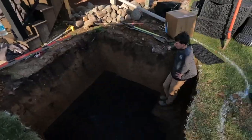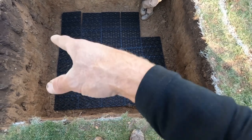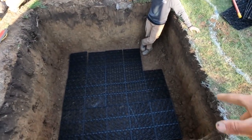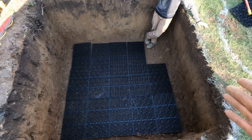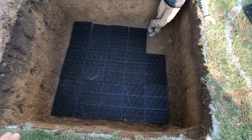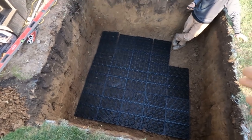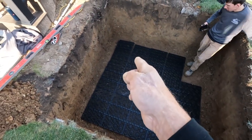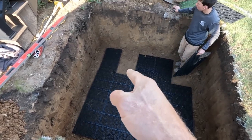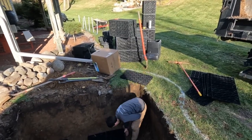We're making headway. We've got the reservoir hole dug. As you can see, we've dry-set 15 of our aqua block panels — actually technically 14; Jack represents the 15th. We just wanted to make sure while we had everything opened up that we had enough room on all sides so that when we put the fabric liner in and then the aqua blocks we wouldn't be fighting any of these walls going all the way down. The pump vault is actually going to sit the second aqua block in from that last row where Jack just pulled out the panel. He's going to go ahead and mark that and get that dug. In the meantime I'm going to keep up with him and get the rest of these 15 double-stacked aqua blocks set.